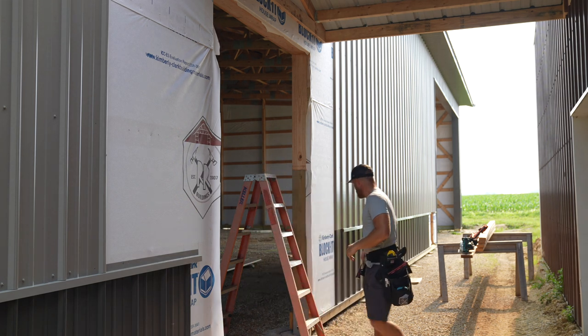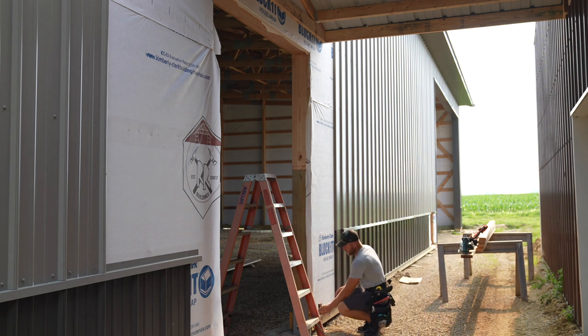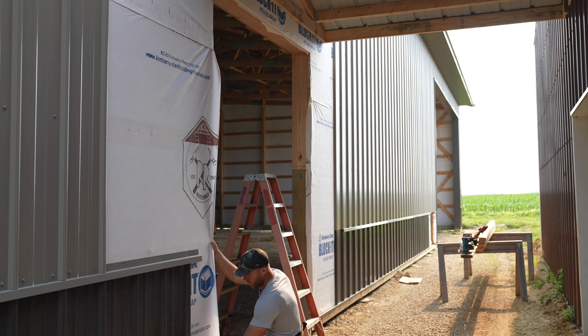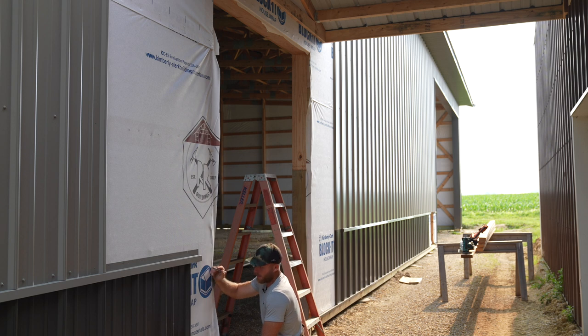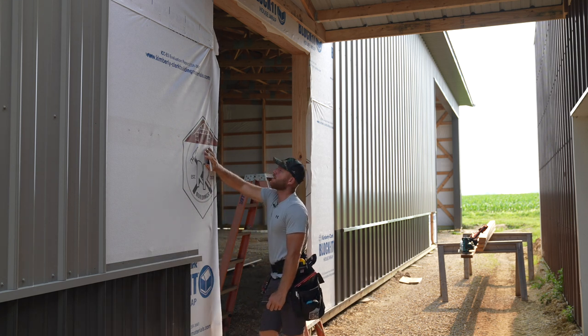So what I'm going to do first is just take my LDM. I'm going to set it on my trim, and 10'4". That is to the top of the base trim. So I'm going to add 3.5 inches to that and go 10'7.5". Well, let's see how good we are over here. That trim might be in my way. 10'4", okay, well, I'm going to say that that's accurate enough because it worked out for my narrative that the building is perfect.